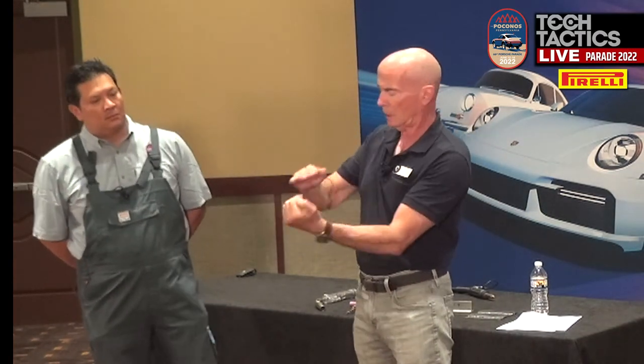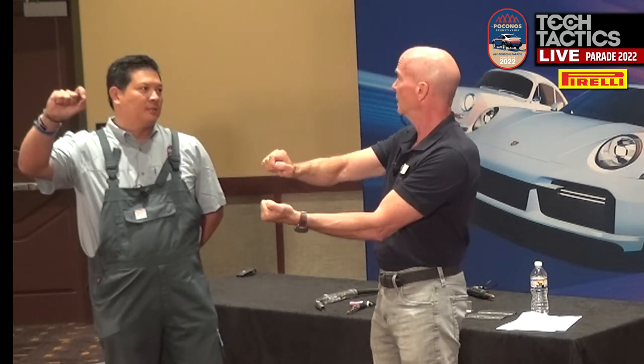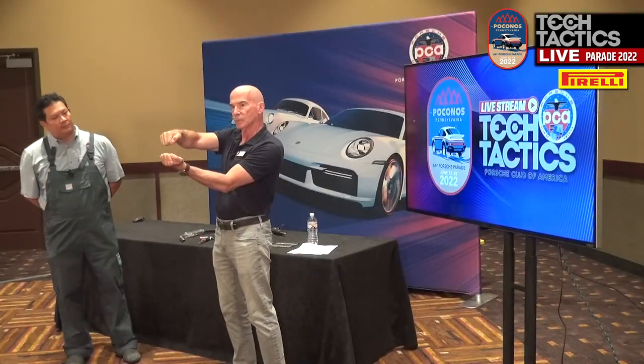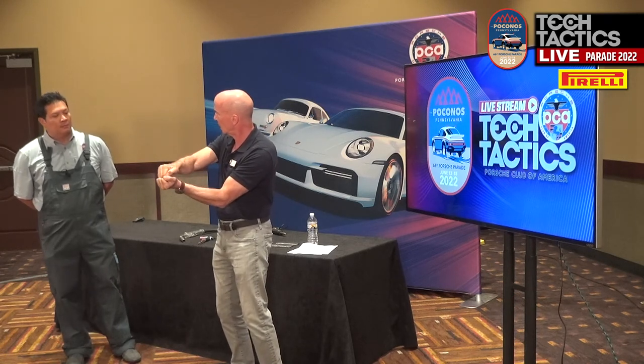Resistance welding — I said there are 813 resistance welds in a 992, which most people call spot welding. It's two arms: I put two plates in, I've got two tongs. They pinch it, put a little force to it, pass some current through it, and because it's in perfect contact, resistive heating heats up that steel, then forces more pressure to forge it together, and depending on the alloy maybe an extra surge of energy to make sure it's stuck. Very simple, very easy to apply process — that's why the automotive world loves it. Look at your 356: lots of spot welds in it.